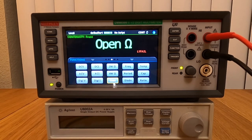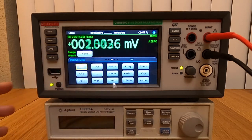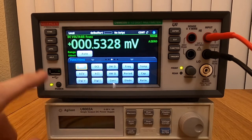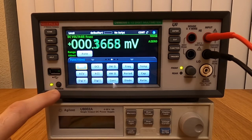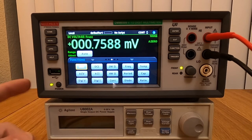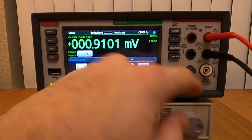Speaking of tones and sounds, there is a fan in the unit. I highly doubt you can hear it because it's actually not loud at all. It might be temperature-controlled because when I started it, I could hear it running first at a slower speed, then a bit faster. For a regular indoor environment, the fan is really not noticeable. One last note about the soft power button: it's probably because they keep the reference circuit active all the time, so when you start the unit you don't have to wait possibly tens of minutes or hours for the reference to heat up and stabilize. That would explain why there's a soft button and not a hardware latching button.